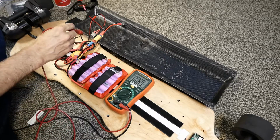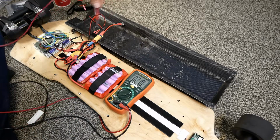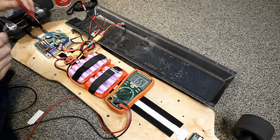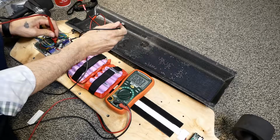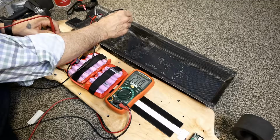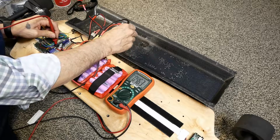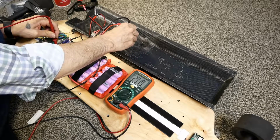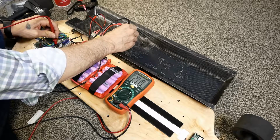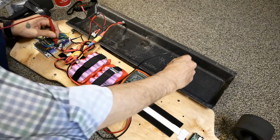Well, if you look right here, I'll point with the red thing. If you follow this right here and this one here, this is ground. So let's check that out. If I go from here to positive, there's our full 29.2 volts right there. So that is definitely ground, okay? Now watch this. If I touch right here, there is also our 29.2 volts. Pretty damn straight. No loss, not much resistance right there. Same thing over there. So why is this?